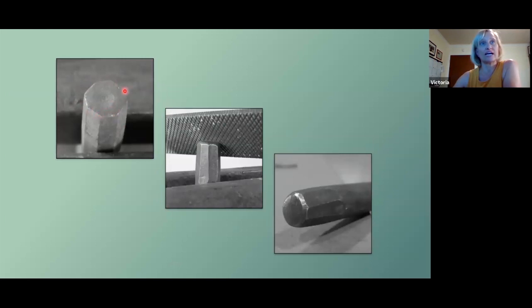So here's our octagon, and this cupping is a result of what happens due to the nature of the material, as the hammer penetration only goes so far. So while it's hot, place it in a post vise and rasp to a dome shape, and then take off these edges. This dome shape will help to prevent the mushrooming effect.